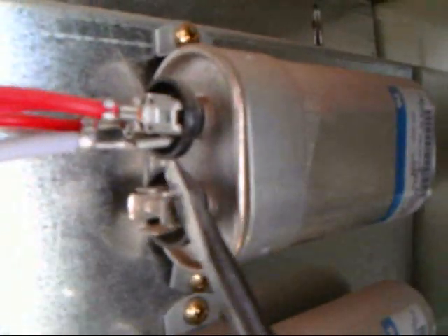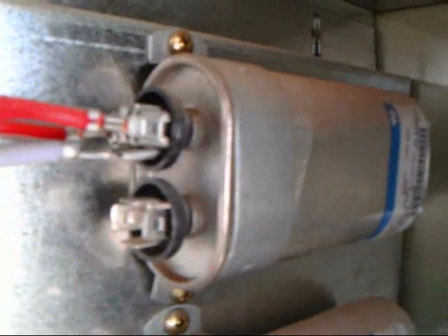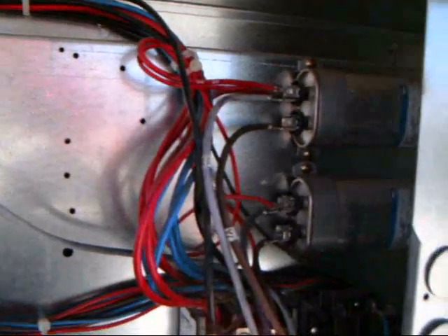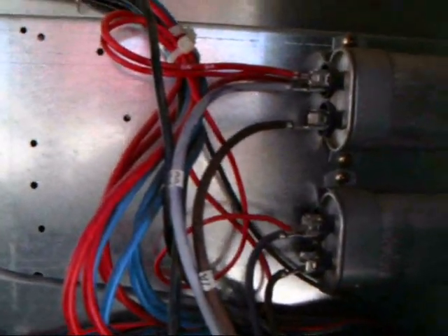The second one. That's the only way to leave any voltage potential left in the run capacitor - pull off one of the leads while it was running. Other than that, if there's nothing wrong with the fan motor, it's not going to have any voltage, because it's going to discharge through the motor windings as soon as you disconnect power from the unit. By the time you flip off the disconnect, take a few steps, and walk over to start working on things, there's no voltage left in those run capacitors.